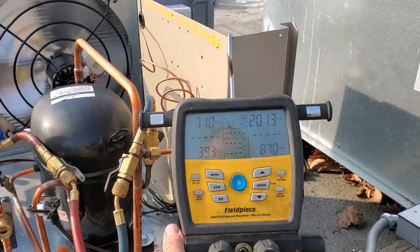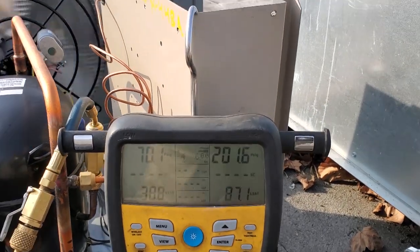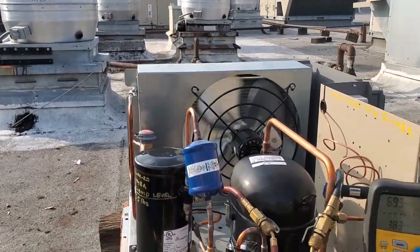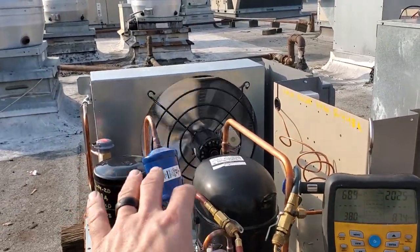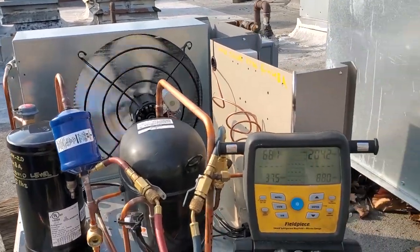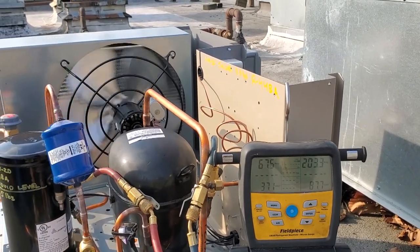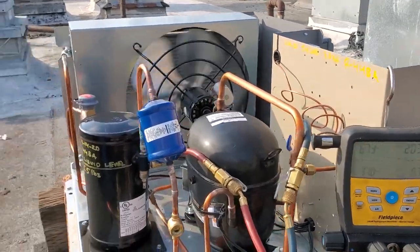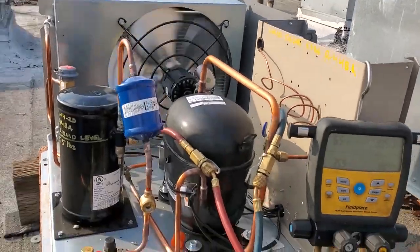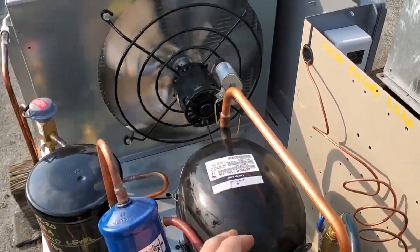I don't have any clamps on here showing you what line temperatures are, but this is our 448A and the pressures of our 448A are damn near similar to what R22 was. Notice our condensing temp — 87 degrees. It's currently about 65 degrees outside, which gives us about a 20-degree condensing temp over ambient, or TD across the condenser — which is about accurate for a microchannel. 68 suction pressure, 37-degree evaporator. My box is probably about 45 degrees right now. I went ahead and marked really good on the receiver — marked right here, marked right there, and wrote on both the top lid and the side lid the refrigerant charge and what's in there. We're still really flooding back on our compressor, so we'll go check the superheat down at the evaporator.